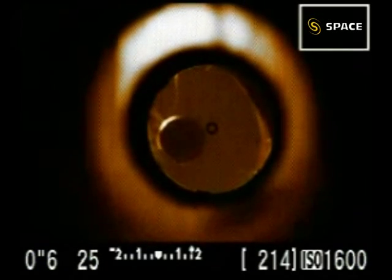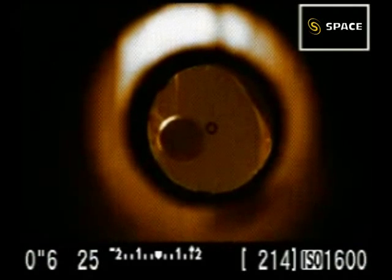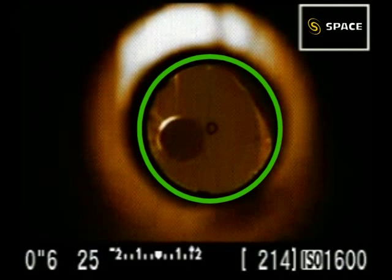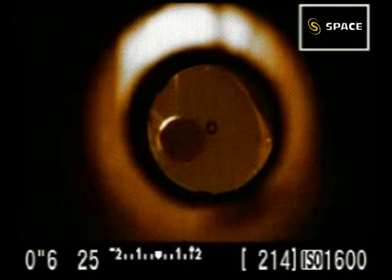But what is this black disc? You can see that it seems that I have an oversized secondary mirror, as there is this black margin around the primary. Actually, this is good. I can move my eye from side to side and still see the complete primary mirror. This means that even the stars at the edge of the field of view will be using the full aperture of the primary, which would have been cut off had I been using a smaller secondary mirror.